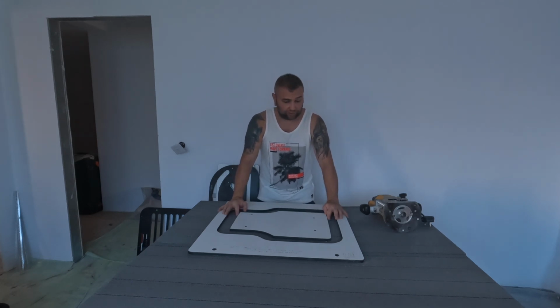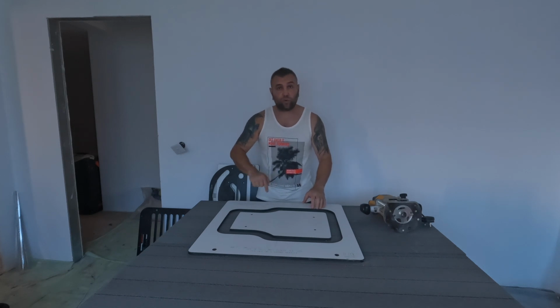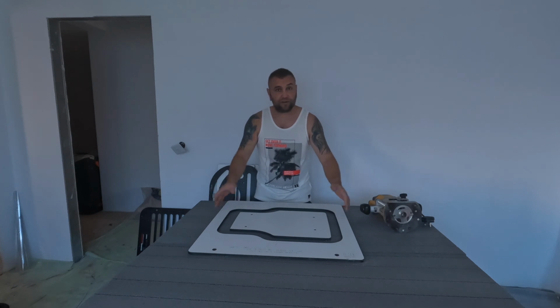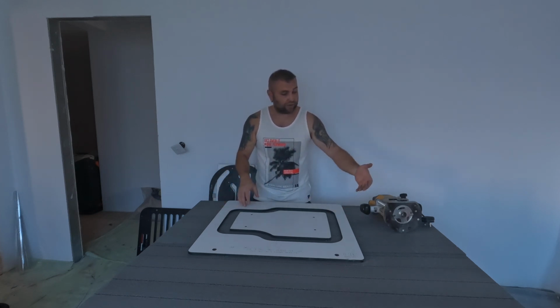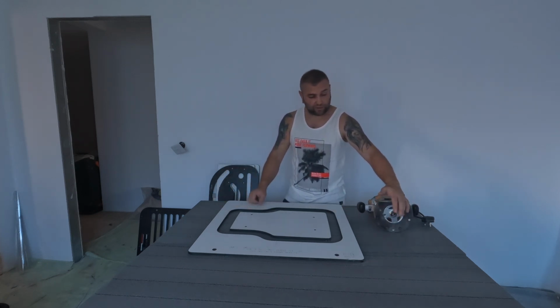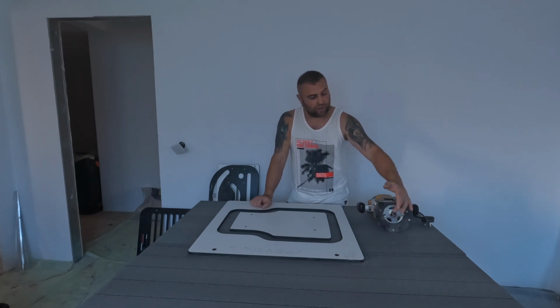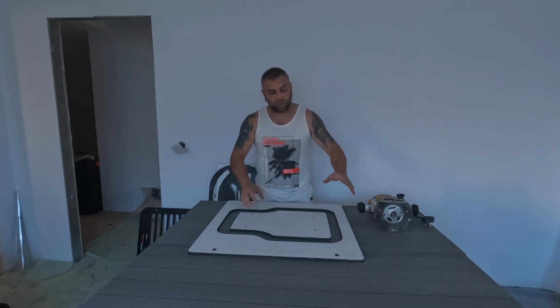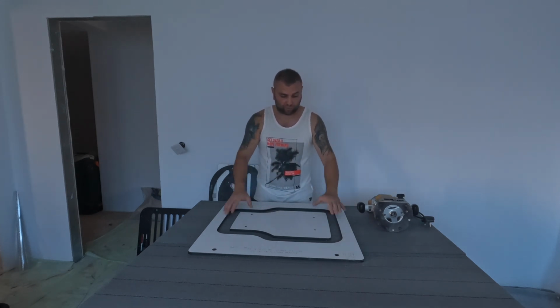And sometimes I like to build my own jigs. If I find an under-mounted sink that the corners are quite square, I like to take a piece of panel or end panel, whatever is left, cut it. It's bigger to obviously accommodate the guide bush. With the experience, you will find out that the cutter is cutting this many millimeters from the guide bush, this many millimeters from the actual line, from the actual jig. So you will be able to calculate and make your own jig.